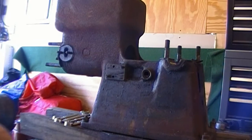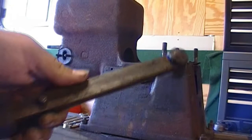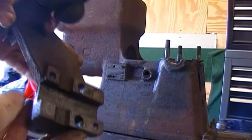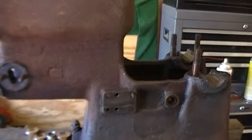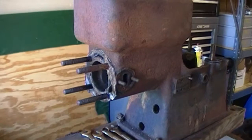Here's the push rod here. A little cam follower wheel. Got a little bit of play in it, but the rod doesn't have any major wear. So that's good. And the governor bracket. See, the rod rides in this slot here. So that's that. And there's two dowel pins to keep it lined up. Yeah, so that's pretty much it. Pull these bearings out, and it's down to the bare block now. That's why I like these engines. They're so simple. They last forever.